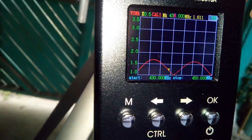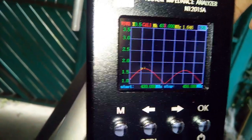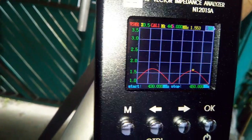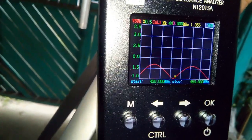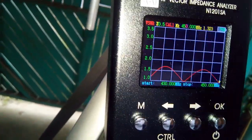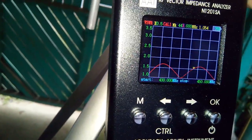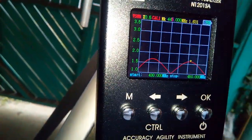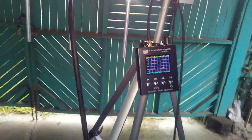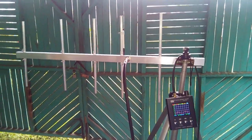The SWR is 1.6 on 435 and also 1.6 on 445. This antenna is actually wideband. However, the advisable operating frequency is inside the curve from 435 to 445. You can use it on 430 with still good performance, but not on 450 — the limit is on 445. Thank you for watching, and this antenna will be available on my Antenna by Panda page.